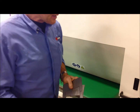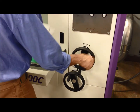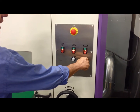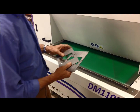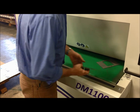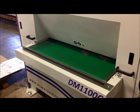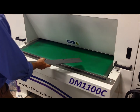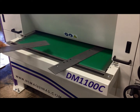Now we're going to run steel at about two and a half millimeters in thickness. The adjustment is real quick — a little bit more pressure, full belt speed. Because it's not stainless we can run a little bit faster — we're going to run at five and a half feet a minute. You can run them in a mix; these will disappear in just about 10 seconds, so that'll be about six times six — 36 parts per minute — and you can run these right away behind it.